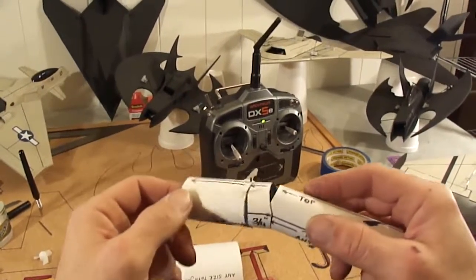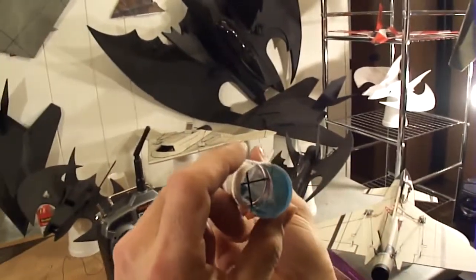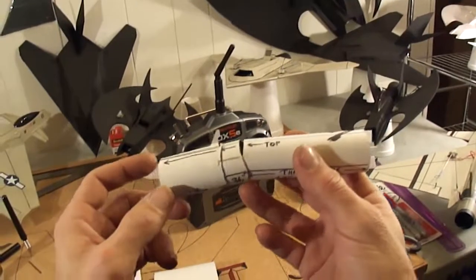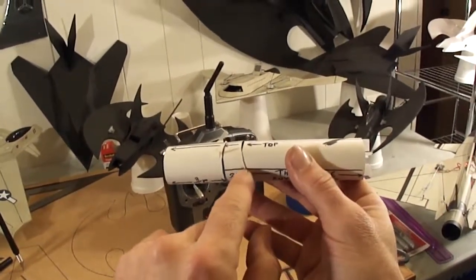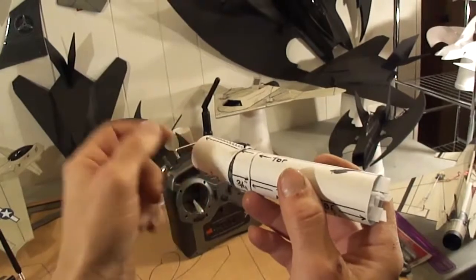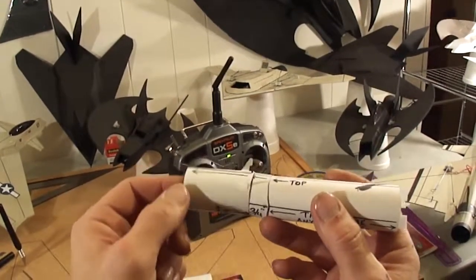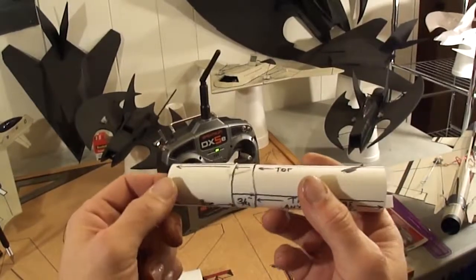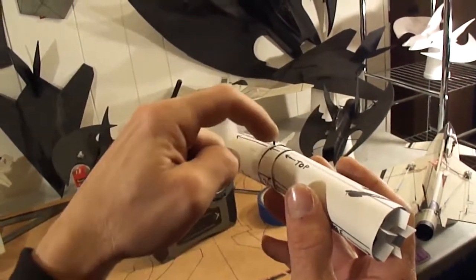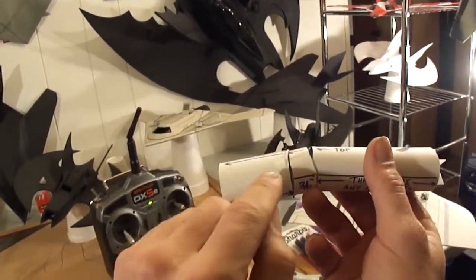It's not going to affect your airflow with this moving around at all, or these openings — as you can see there, you can't really see through those cracks at all. Just make sure for your up and down movement you're going from side to the other side at your first pivot. Then for left and right, you're going to use the carbon fiber rod coming down through the top and through the bottom. Then install your micro control horns on the center of these two pieces of carbon fiber rod — find your center point of those two. The control horns are on your thrust vector nozzle.